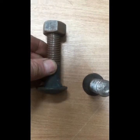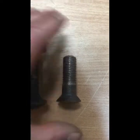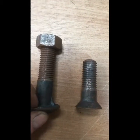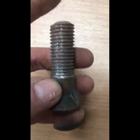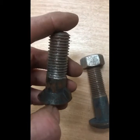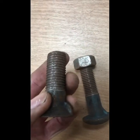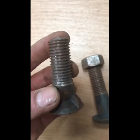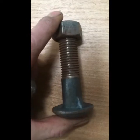These are the bolts for mounting the AWSs to the AWS plates. They come in two sizes — a short and a long one. The long one is very similar to the mounting bolts on the old EP point machines — mushroom-headed or flat-headed, with a small counter-sinking noggin. Once these have been in for a few years, if they weren't given any grease or oil — and let's face it, once they're put down they tend not to be moved — they will have all furred up inside and be a struggle to get off. They're an absolute nightmare to get your bar underneath. You have to put a bar underneath the plate to try and jam it up so you can take the nut off. If you've had a wet spot underneath an AWS and the P-way have come to change it, you'll find all that bouncing has rounded the head off into the little hole in the plate.